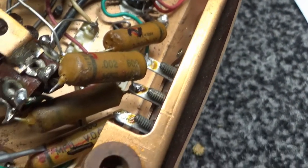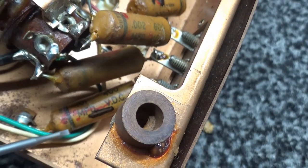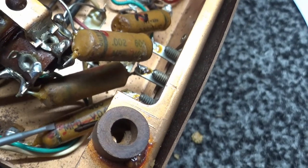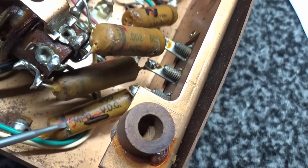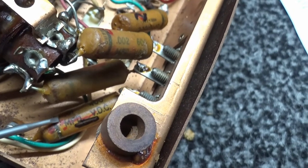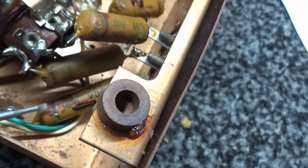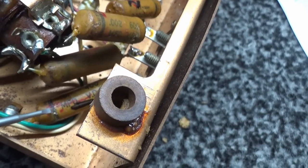You'll notice this little black bar, this mark right here on the capacitor. That does not mean negative. That does not indicate polarity. On that capacitor, that actually indicates outer foil. These things are the foil. The dielectric has one piece of aluminum strip, dielectric and another, and to get those strips in here, it's rolled up just like a big cinnamon roll or Yule log, whatever. But the outer foil is what this is denoting, which means this outer foil is connected to ground.